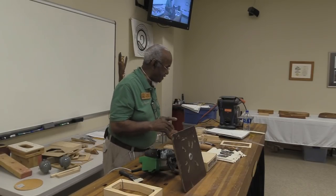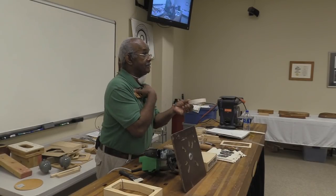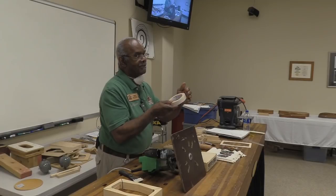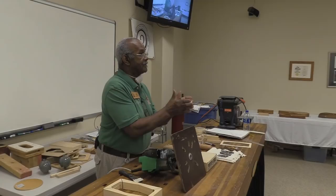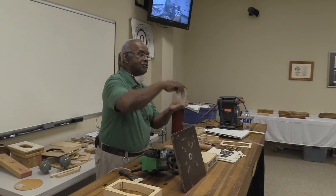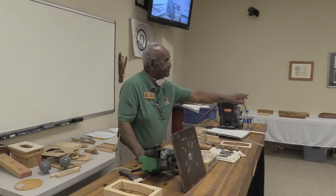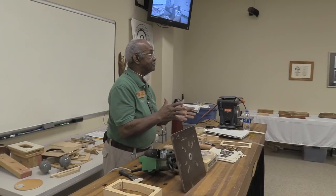If I wanted to route the box on its side I don't feel comfortable on the router table — that's just me personally. But anything you're going to do that you're having problems with: practice, practice, practice. The more you practice the better you'll get and the easier it is. I don't care whether it's shaping on the belt sander or whatever — that box is rough but feel the outside curve on it; that's shaped on my belt sander with 120-grit paper, that's all I use.